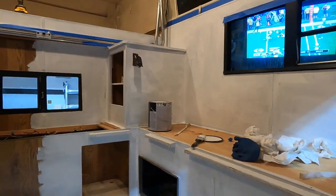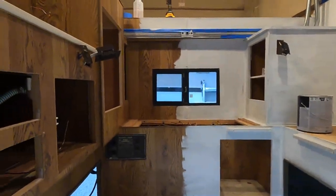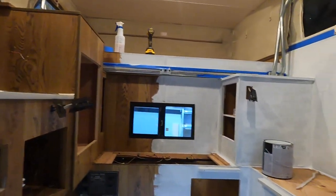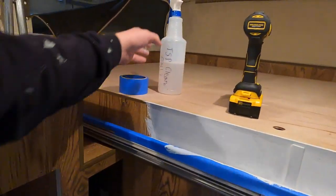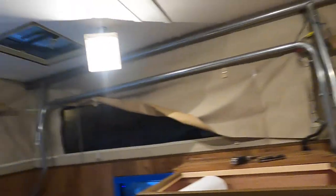Inside here you can see I've already done some work — I am currently priming the camper interior. I wanted something a little bit lighter; the wood grain just wasn't doing it for me, so I wanted to lighten it up and make it more airy. In my last house I painted cabinets using this same method and it worked out really well, so I've decided to do the exact same thing here to make sure it lasts a long time. The first step is to clean all the cabinetry with a TSP cleaner — you can find TSP at pretty much any hardware store, mix it with water in a spray bottle, and it really helps get the grime off and prep it for primer.